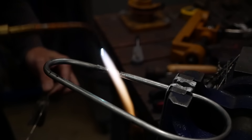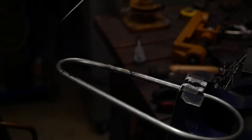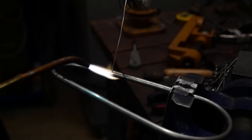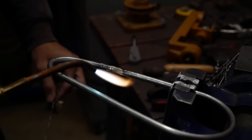See how I got a little red there? That's good - now I know that's hot and the silver is going in that way. Now I'm going to try and build up around the joint so that we can file it and it looks smooth afterwards.